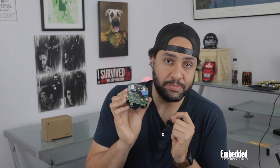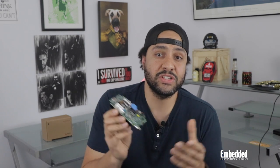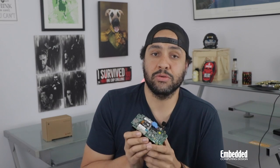The Jetson Nano, which is tucked back here, levies a quad-core 1.43 GHz ARM Cortex-A57 CPU and a 928 MHz Maxwell GPU with 128 CUDA cores against vision workloads running on the kit, and delivers up to 472 GFLOPs of performance in the kit's 130mm x 72mm x 43.8mm form factor. Supporting these memory-intensive workloads is 4GB of 64-bit LPDDR4 memory and an additional 16GB of onboard eMMC storage, as well as multimedia interfaces for piping data in and out of the system.